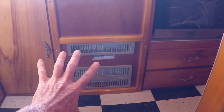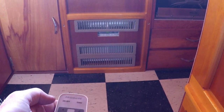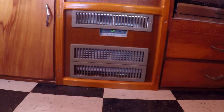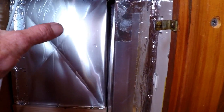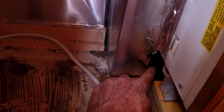I did find a place to mount the AC unit. It's just a Frigidaire window unit - this was honestly one of the hardest parts of this trailer. It's an 8,000 BTU AC. You can access the controls from here; cold air comes out of the top, return on the bottom. I made the entire interior panel removable so you can service it easily. The most difficult part was ducting everything - air comes in, goes across the coils, and I had to make another section behind it so the hot air gets dumped outside again. I also had to build a drip pan to catch condensation.